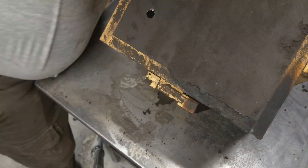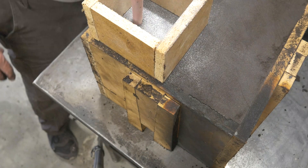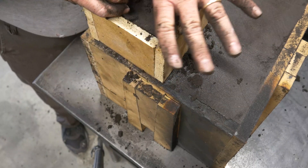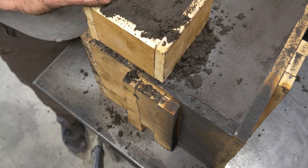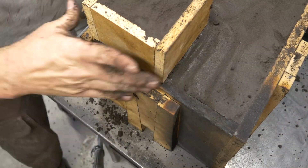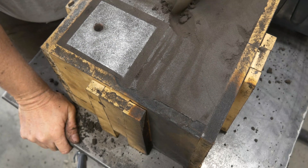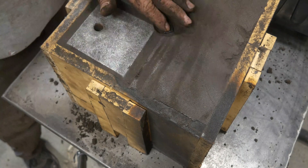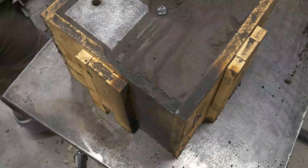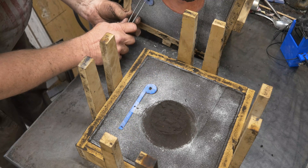I had to kind of roll it - it's too heavy to pick up. I've made a sprue extension. Basically I modeled it as if my sprue were extended about 150 millimeters up, and I kept that angle. I dropped it down into the original sprue hole - which is probably a terrible evil wicked thing to do - but I'll blow it all out. I'm building that extension box so I can get more height out of my sprue. The reason is that with the trouble I had getting that original crown to fill, the assumption is I didn't have enough height for the metal to seek its own equilibrium and get high enough into the mold.